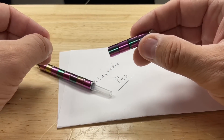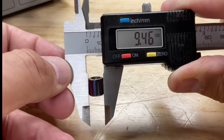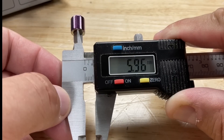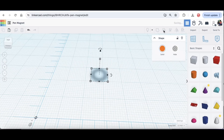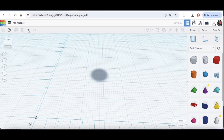I had to get dimensions from the magnets first, which was a bit of a challenge because they kept sticking to the metal calipers. But I got all the dimensions including the inside diameter, then went to Tinkercad and easily reproduced the piece. All I did was take a cylinder, ran a hole cylinder through the middle to make a 6mm hole, and grouped them together. Very easy to do, then I exported it and sliced it.